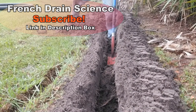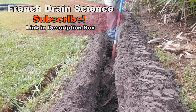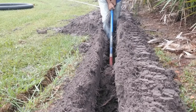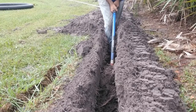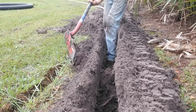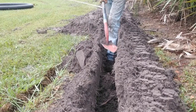Normally I tell you to dig backwards, but we're cleaning the trench, so I'm going to actually go forwards and then come back through it again. Try to push your body weight, get down to the bottom of the trench where you put that trencher, pull out that soil, just set it right beside the trench because you've got to put it back in. It takes a little while but it's not that hard to do. Now I'm getting here where I stopped and I'm starting again — so it's a lot of soil. I'm pulling out heavy soil and it is a tight fit. You can see I'm really pulling that soil up out of that trench, but you can do this. This is something that will save you thousands of dollars.